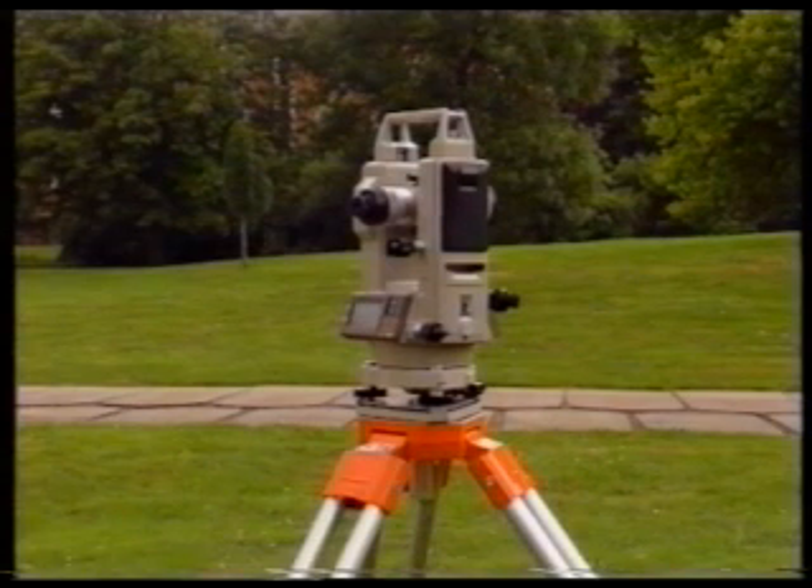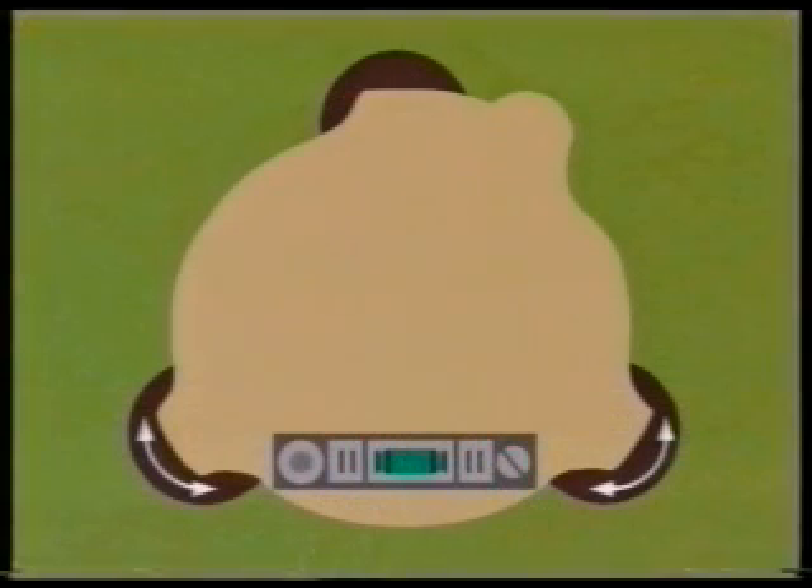It is not unusual for bubbles to be slightly out of adjustment. Once you know the positions of the bubbles on your theodolite, you can set them up straight away without going through the full procedure. If your theodolite only has one plate level, you carry out a similar procedure by bringing the bubble to the middle of its run in position one using the first two foot screws, and in position two using the third foot screw. You then note where it comes to rest in positions three and four, return it to position one where you take out half the error using the appropriate foot screws, and do the same in position two using the third foot screw. If you now carefully rotate the theodolite through 360 degrees, the bubble should remain in the same position, indicating that the horizontal circle is lying in a horizontal plane.